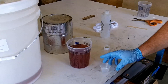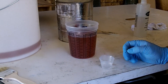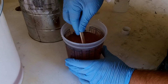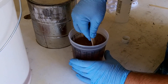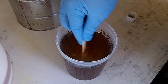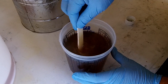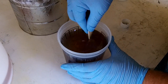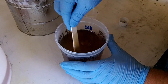I've got my polyester resin here — going 700 mils and mixing this at probably 1.5 to 2%. Right now I've got a little over 10 milliliters of catalyst in here. You just throw it in there and mix it up with your tongue depressor. You can see it's changing colors a little bit — it goes from a really orange color to more of an amber color. It's pretty warm today so we won't use as much catalyst as on a cold day. If it's setting up too fast, switch to a lower amount; if it's not setting up fast enough, add more catalyst. That's the beauty of polyester resin.